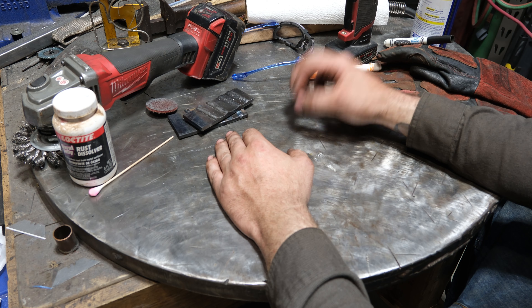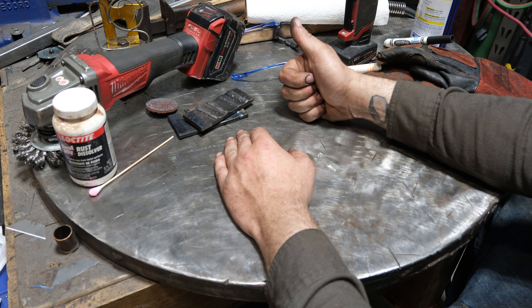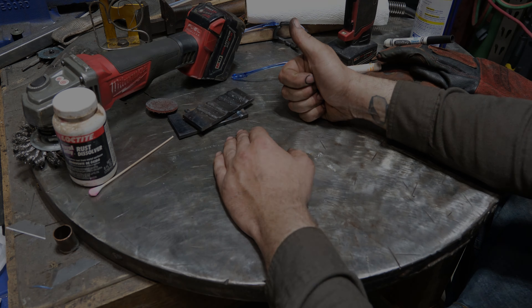It goes without saying you do not want to run rods like 7018 or 6010 on a polarity other than what they're designed for when doing code work where polarity is specified — you'll have problems for the previously mentioned reasons. Short-circuit MIG on C25 or C100 gas should be run DCEP. Based on the results we saw, running straight polarity with MIG is not an option. AC is also not an option — I'm not aware of any MIG welder that welds on AC. Spray arc is DCEP, dual shield is DCEP.